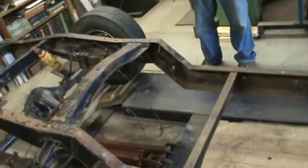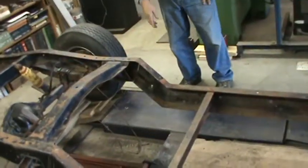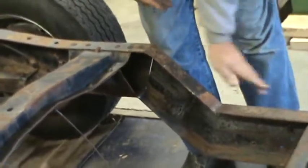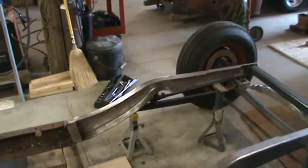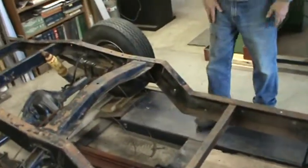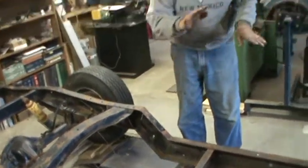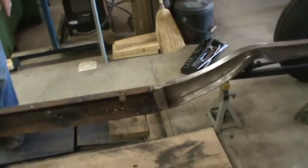22.5 degrees which makes a 45. When we do that we lose a little length in the frame rail. You can see — you V it, or cut a pie out of the bottom and then a pie out of the top, and then just bend it. The front of that comes back, so it kind of shortened our frame a little bit. But I think we made up for it with the addition of those 32 rear frame horns. We tack welded it in place — it was just a matter of making the cuts. We did it with a Sawzall, that worked real well. We TIG'd them in place just temporarily at the top and bottom so it holds where it belongs, made sure everything's square and parallel, then worked our way forward. Grafted those on with Brian's help. What you see is what we got — it looks like the start of a pretty decent frame.